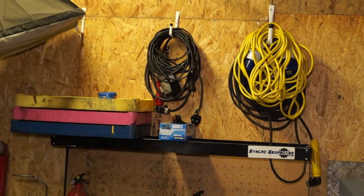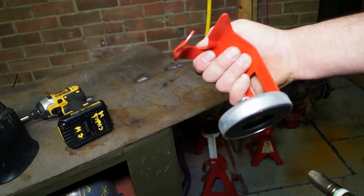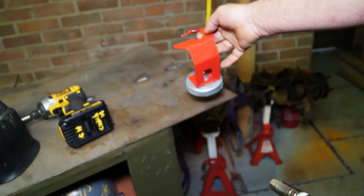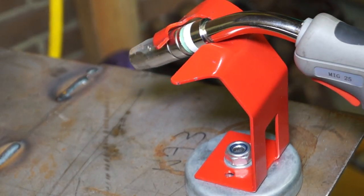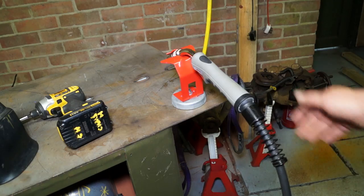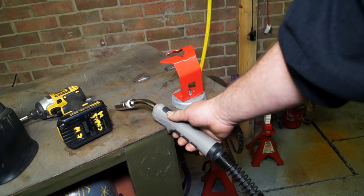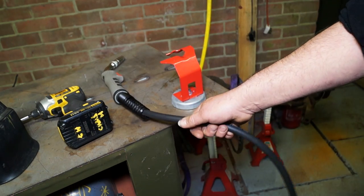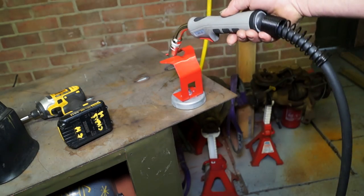These are not being made redundant — they're all part and parcel of the equipment. The other piece I got off him is a MIG torch stand. You might not think this is necessary until you put your MIG torch down and it sets itself off. This is an excellent holder, very handy to keep by your workplace. Sometimes you put the torch down and it sets the trigger off, which is not good. These torch cables have a life of their own.